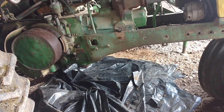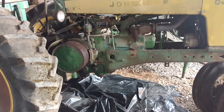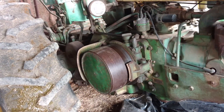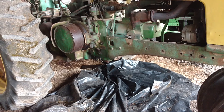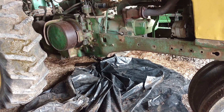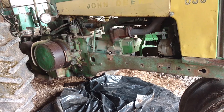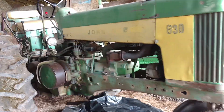Anyway, this is a good little trip to the starter shop — I got on a tangent there. These were durable old things; they served a purpose a long time. I don't necessarily hate the tractor, though it's a little aggravating to work on. It's the only tractor I'm aware of where to remove the crankshaft you have to take the right brake off. But they were designed for farmers who had no cement floors, no jack stands, no way to split anything — the idea was a tractor you can rebuild without splitting it in half.